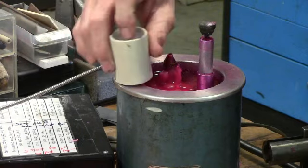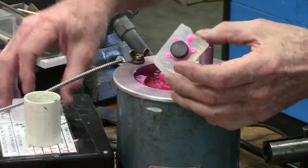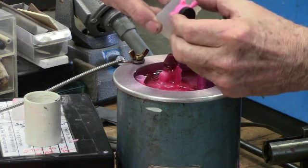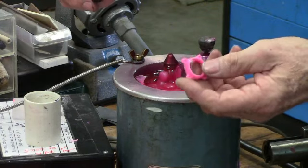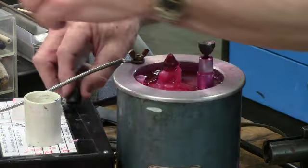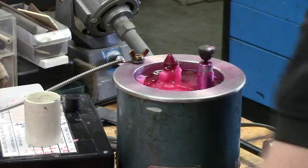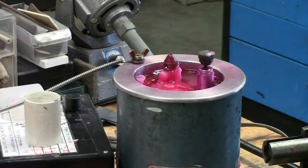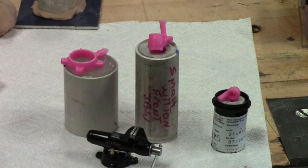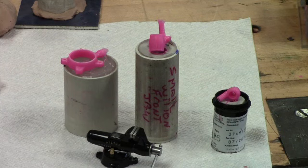Got another one. The last one that we shot on the first go around was the base for the Wilton vise. The big black core, I think it's a piece of Delrin, helps form the opening in the base. So what we'll do is we'll try to group them and put one of each wax that we just shot in a grouping along with the body. Okay, here's a group shot of the three molds that we just injected with a sample of the wax that we took out of the mold, setting on top of each mold and the little vise in front of it.